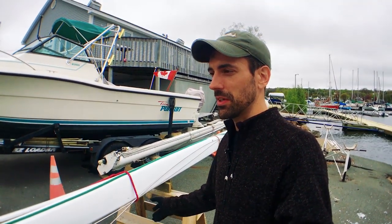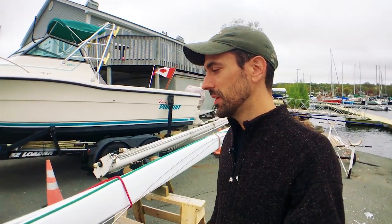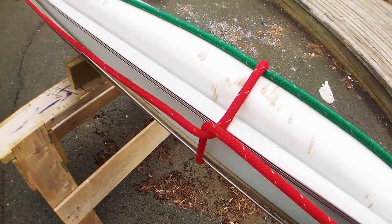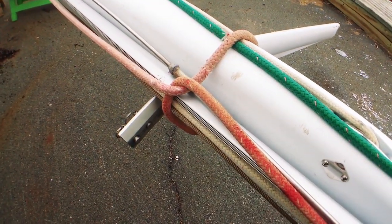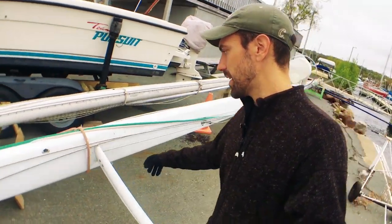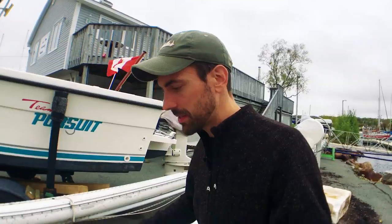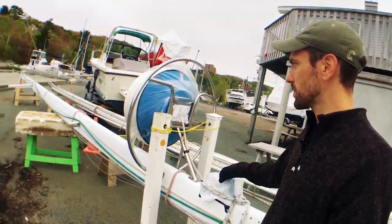This is something that Noelle and I aren't going to do very often. I think it's certainly not something we do every year. But what we did was we took one of the halyards and we ran it along here and just kind of did a half hitch every, I don't know, 4 to 6 feet or so. And that's simply just to keep the head stay, like the furling head stay, and all the shrouds and everything attached to the mast so they don't go falling onto the pavement down here, and to keep the roller furler from bending.